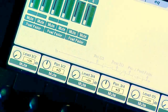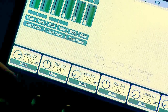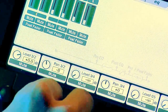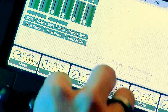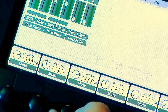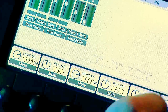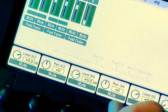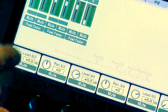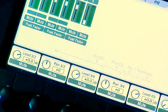We take the knob for levels 1 and 2 and turn it up to zero decibels. The second rotary knob becomes your pan, so you can pan left and right on the matrix section — today we're keeping everything centered. We take matrix 3 and 4 up to zero decibels as well. Then we go to level 5 and turn that up to zero. So now: high/mid frequency (1 and 2) are fed at 0 dB, low frequency at 0 dB, and subs at 0 dB — everything is even.